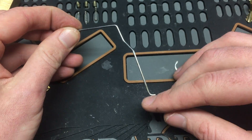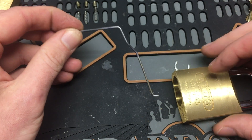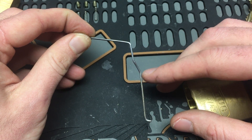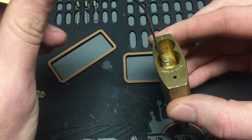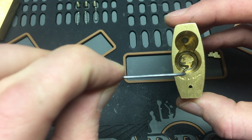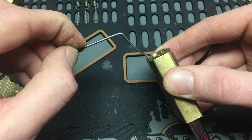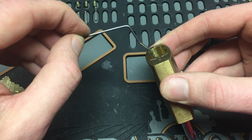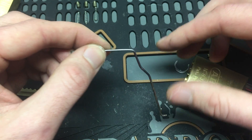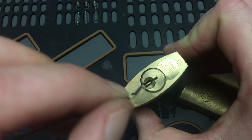This is the toe and the heel that will fall between the triangles of our cam and actuate the shackle. All of this right here up to that bend is the height I need to be at. When I'm on the absolute back of this, I know that's my depth check — as long as that bend is right on the lip of this lock, I know I'm at the right height. The bend back is just to get a little more room between my fingers and the keyway so when I drop it in there I can see what I'm doing.